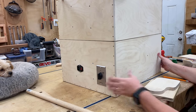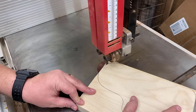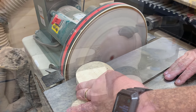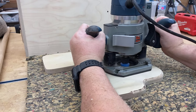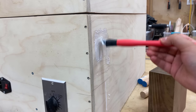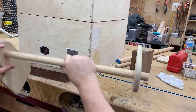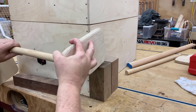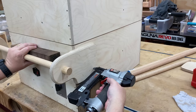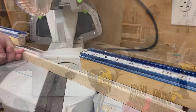This is a big, unwieldy box so I added a handle. I traced a shape out of three-quarter-inch Baltic birch plywood, sanded it smooth, and routed the edges. I used a one-inch oak dowel — oak is very strong — drilled a one-inch hole through both side pieces, applied a little glue, fitted them loosely onto the dowel with spacer blocks to set the correct height, and screwed everything in place. I did the same on the other side, making it much easier to carry.